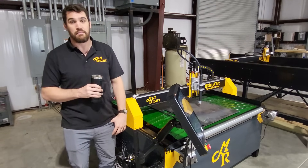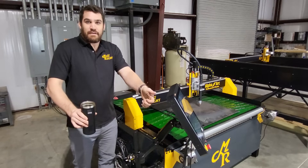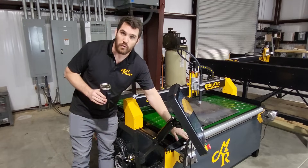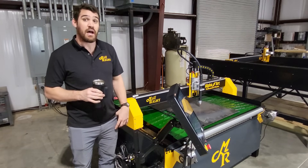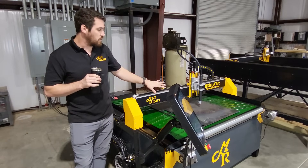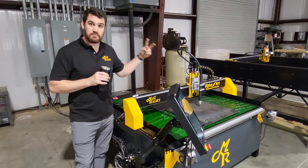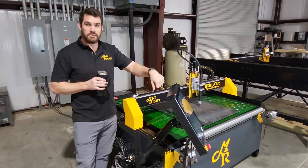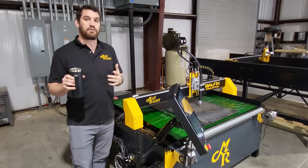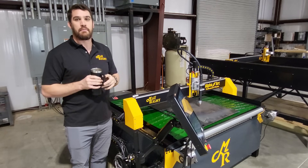We've got a front roller that makes loading a heavy sheet a lot easier. If you've ever had to load a half-inch sheet, a quarter-inch sheet, or some 10 gauge, it's going to be much easier with this roller that comes standard with the machine. There's also an optional air ballast system. If you wanted to drop the water level on the machine, you could do that using the air ballast — there are two different valves, one that drains the water and one that lets air pressure into a ballast tank to raise the water level. You get about three-eighths to half an inch of variable height using that optional air ballast.